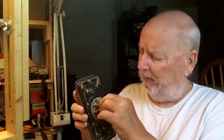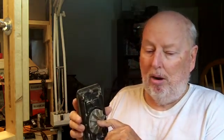I've checked different things that I could use. A nut will fit, and I've got no nut now. I used to have a nut. I don't know what happened. Anyway, it will fit in there. It makes a little bit of a clicking, you know what I mean? It will turn without actually turning this. So it would have had to be JB welded in there. So what I thought was the washer idea. What I'll do is probably stick 4 or 5 of them together with JB weld and clamp those and make sure they're nice and tight, and then shape them as needed.